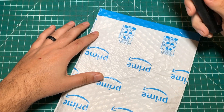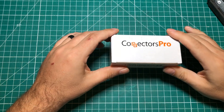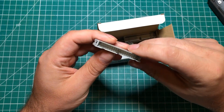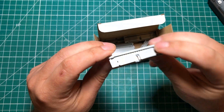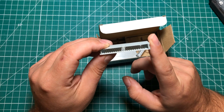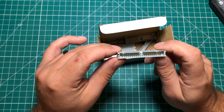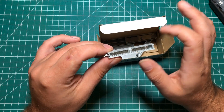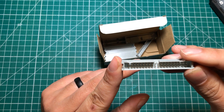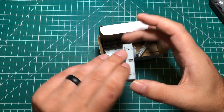Next up we've got another Amazon package. This is Connectors Pro — still don't know what this is. These are male 34-pin 2.54mm pitch connectors. I got these for a reason that will come to me very soon. I have some devices that are 40-pin female, and I looked at buying cables to hook them up when the device isn't in the orientation or location I want. Those cables were fairly expensive, so I got the brilliant idea to take a standard IDE cable and crimp this on there.